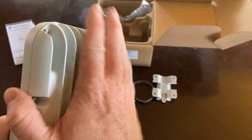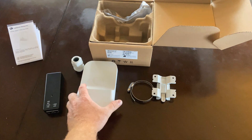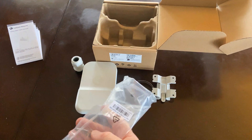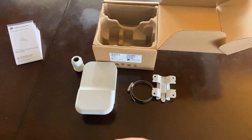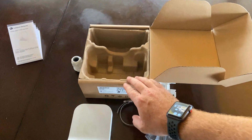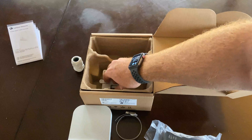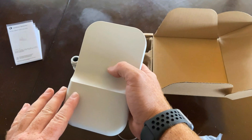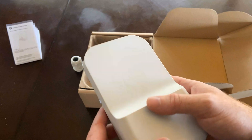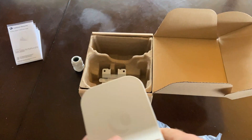Another initial takeaway is that the heat sink on the back is metal — it's really nice and you can feel it's got a decent amount of weight to it. When I was talking to Cambium about this, one of the questions I asked is why is it so heavy if it's based off a commodity inexpensive chipset? What they explained is that it's not just the chipset and power demands drawing the high current — it's also the unit's processing power. This is a product line they're building for the future. They put extra processing power into their very inexpensive subscriber module unit to be able to handle a lot of clients, a lot of packets, and a lot of traffic, really hitting it hard without failures due to overheating or insufficient processing power.